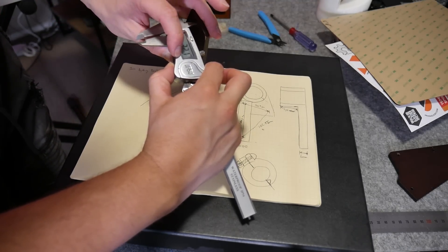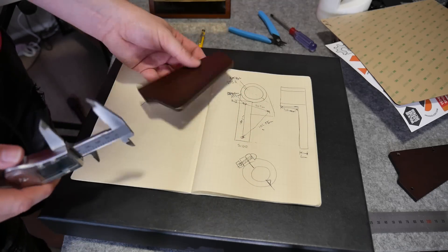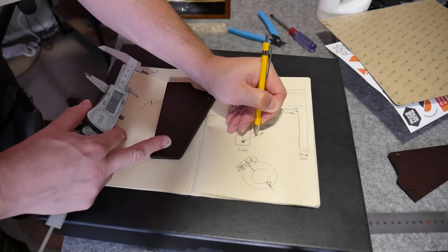I've gone around and grabbed my dimensions. Taking the sidewall off this module reveals all the electronics, but thankfully there's a wood piece and a metal piece. The metal piece can go back on to cover everything up, so I can use the existing screws as long as my plastic replacement part is the same thickness — that works out quite well. This is what I've come up with after measuring. You don't have to be a professional draftsman; the whole point is to measure accurately, mark things down, and figure out what you want to do before going into 3D modeling, so you're not going back and forth. This sketch is your guide to creating a good 3D model that hopefully works first time — usually it takes two goes.